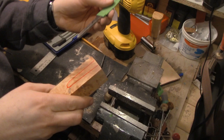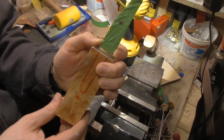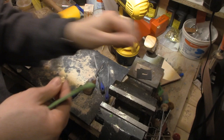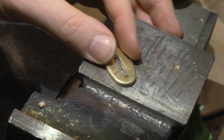Let's do a test and see how close we are on getting this to fit in there. Getting closer — and we are in. The tang has been fitted, the inside of the handle has been all hollowed out to fit the tang well. The next step is I'm going to finish the bolster exactly how I'd like it to look. I'm going to try a hammered look — just going to get my hammer and hammer on there to give it a little bit of a different look. You can see the peening I did on the top of the guard there — I think it looks really cool, something different I've never done before.